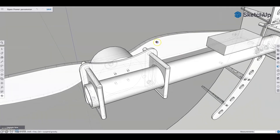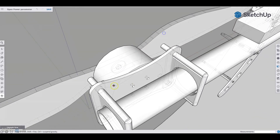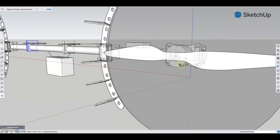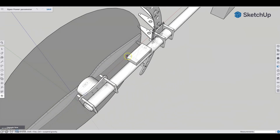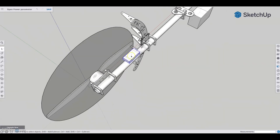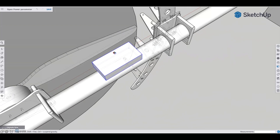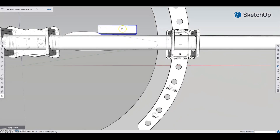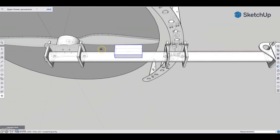First, we've got our motor here. This is a T-Motor U13 — should be good for somewhere in the 50-pound thrust range, swinging a 32-inch 11-pitch propeller. That runs off of a speed controller whose amperage is yet to be decided. I'm going to start with 120-amp, which should really squeak by. If it doesn't, I'm prepared to shell out for 180-amp, but it seems excessive for a motor that pulls a little over 110 at peak.